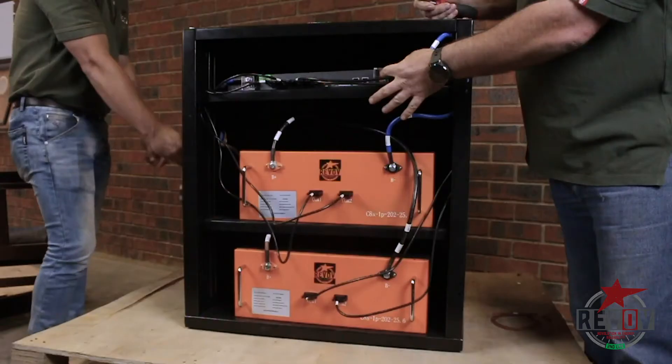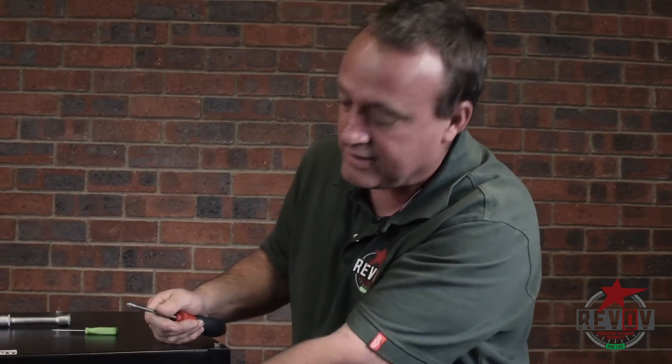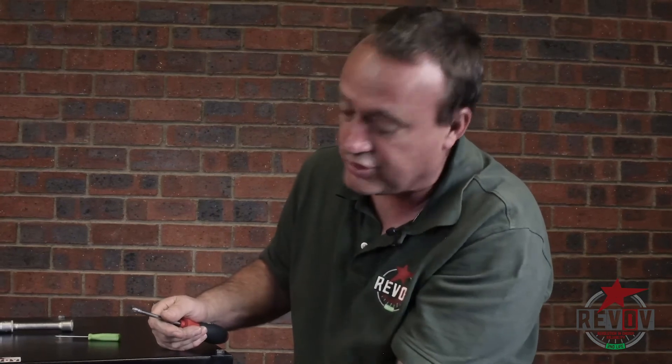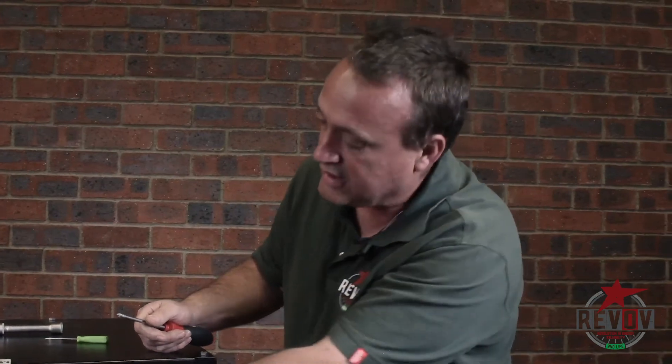Just a footnote — both of these are interconnected inside the BMS, so it doesn't really matter which one you put it on. You can put it on the top or the bottom — either side, they are interconnected inside the BMS. That's done actually to share the load, so that you can actually put two cables in of a thinner thickness to actually feed to the BMS.